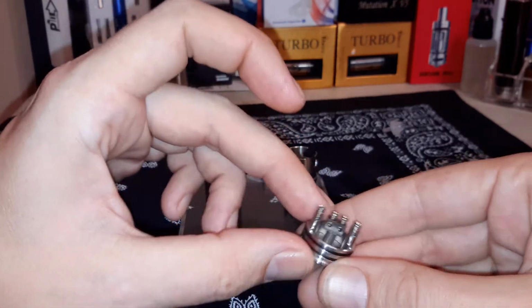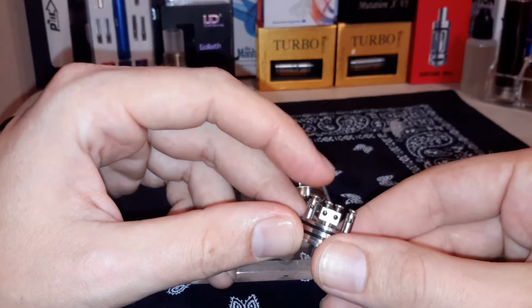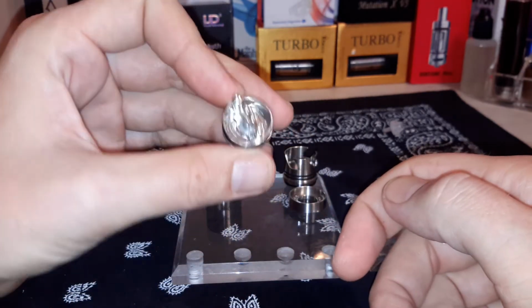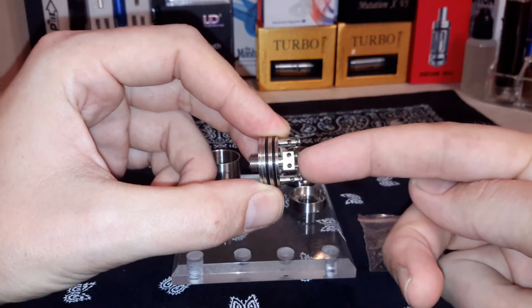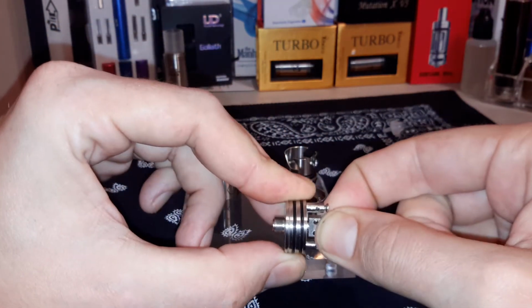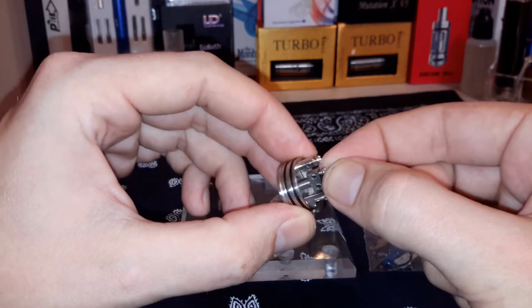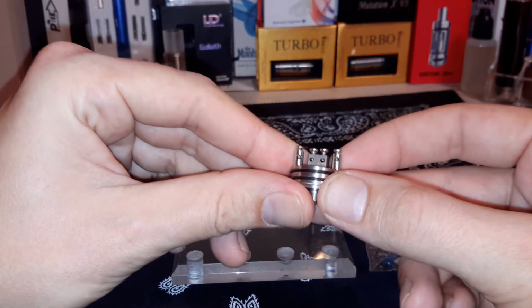So the solution for me, I just pulled those 2 screws out of the center post, and I took my Dremel with a sand wheel attachment, or just whatever grinder, and ground some off. I did look at pulling the post out. It is pressed in so it won't spin. I did like that feature. I don't want to pull it loose and break that seal and then have it spin on me. So I did it just by removing the screws.